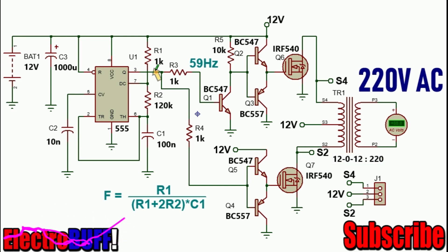When the output at PIN3 goes high, Q1 will conduct and it will pull down the base of Q2 to ground, so Q2 will turn off. Q3 will also conduct, disabling the gate of MOSFET Q6, which will remain off. At the same time, Q5 will conduct because its base will be pulled up to VCC, and current will find its way to the gate of the lower MOSFET, which will turn it on. Current will flow from the 12V supply through the lower winding through the MOSFET into ground.